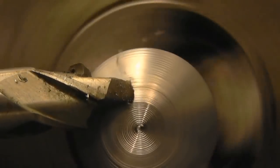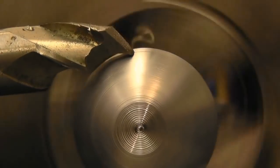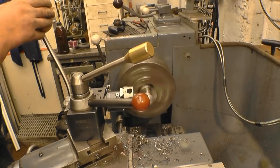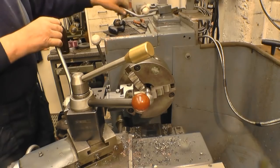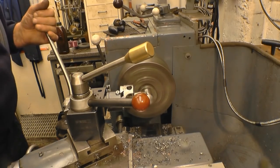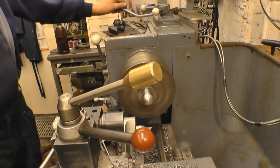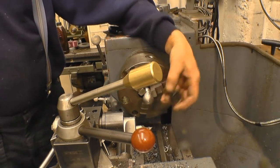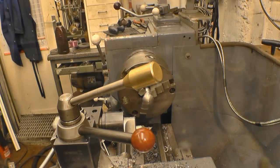By advancing the lead of the carriage, it's just about there now. I'm going to speed it up and see what sort of finish I can get on this. I think that's pretty good. I'll just knock that little bit off and put a nice chamfer on the back of it and that's going to do the job quite splendidly.